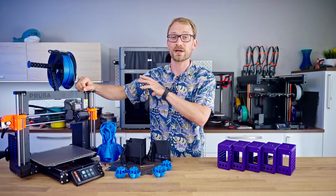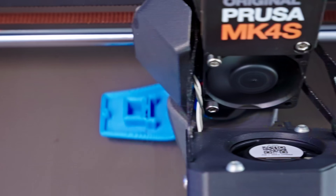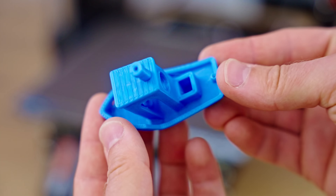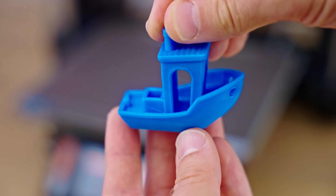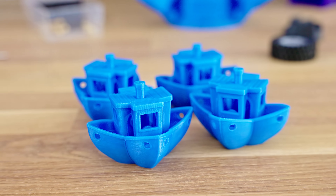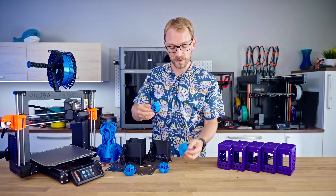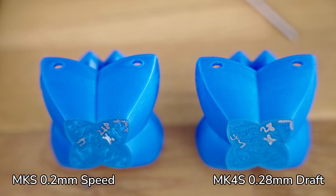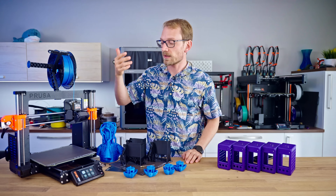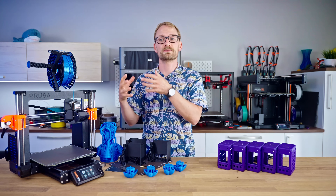For an absolute time comparison of how fast the MK4S can print, there is a 14-minute speedboat race-compliant Benchy pre-slice for this machine, and it actually looks really good — though it's not something the stock slicer profiles will do. I also printed Benchy bows, which are parts that typically curl if printed too hot or with insufficient cooling. Between the MK4 at its maximum speed profile and the MK4S at its fastest profiles, all the Benchy bows printed with zero curling. The profiles tuned for the MK4S, combined with the new fan and high-flow nozzle, are very much tuned to be universal and not situational.